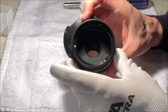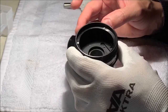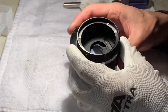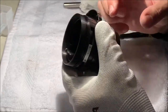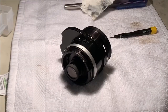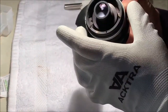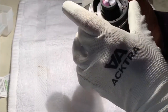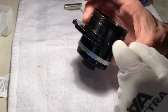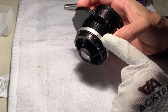Perhaps we have to take this top plate off and that'll let us lift the whole filter wheel out for a good cleaning and give us access to whatever is behind there - there's a lens in there behind the assembly. Realistically all the lenses are in this little space right here besides the giant objective. I'll probably go at both ways because I want to get the filter out for cleaning and the optics out, then deal with the greasing and cleaning of the focusing mechanism.